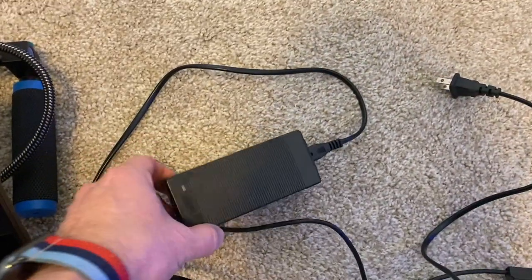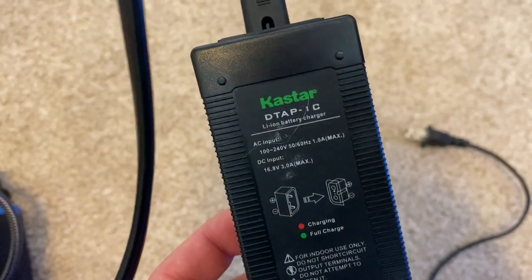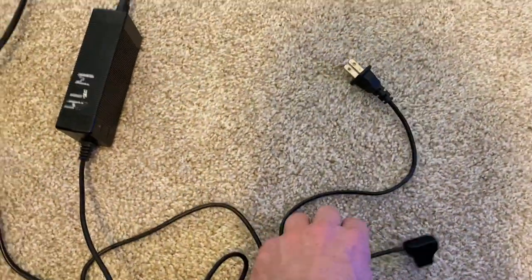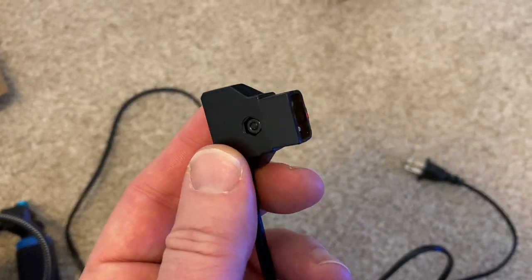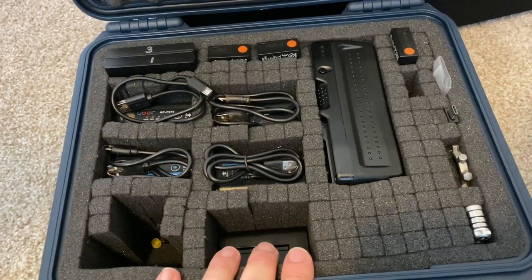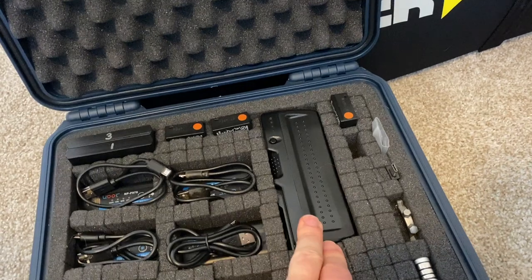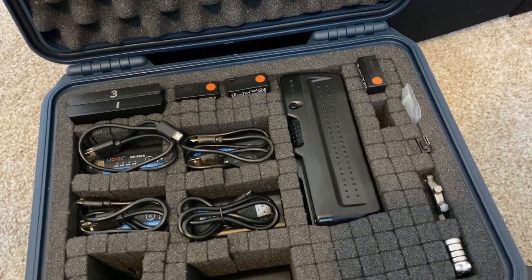Interestingly, the V-mount battery did not come with a charger, so I got a D-Tap charger — I'll put a link in the description. I always write what the chargers are for on mine because they all get confusing. You plug one end into the wall and the other end into the D-Tap — the same place that gives power to the monitor — so it charges and uses power from the same spot. I keep a second battery in my case, so at the end of the day I pop off the one from behind the monitor, plug it in to charge, and stick the fresh one on the back of the monitor so in the morning there's a full battery ready for the day.